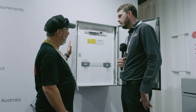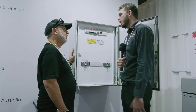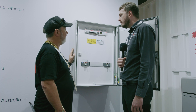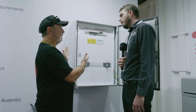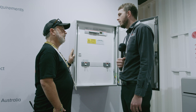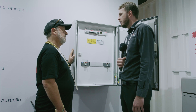In terms of maximum ratings, what would this go up to? This one is a 150 amp board for the SolarEdge 82.8 kilowatt. But we have different designs that go up to 400 amps. The 400 amp is actually a bit taller — mainly due to complying with the new standards, with the heat rise and the physically bigger components in there.